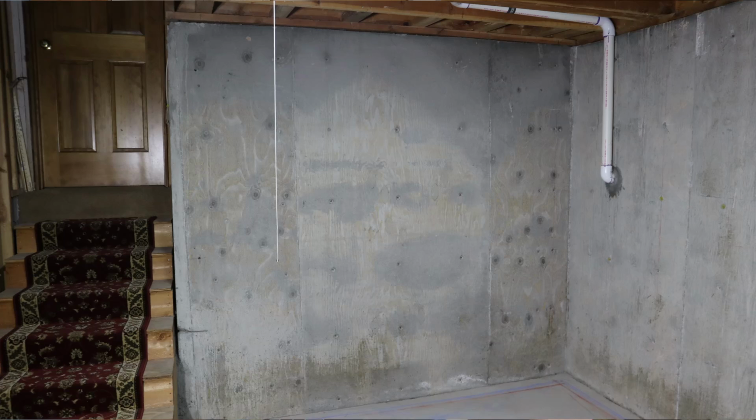And I discovered I had some issues. On the wall directly behind the camera, the center of the wall is bulged out enough that a 1/2 inch gap isn't adequate. And this wall is leaning in a little bit, and in some spots more than a 1/2 inch. So I'm going to have to step my wall out on both these walls more than I had anticipated. And the wall directly behind me is not only leaning in a twisty sort of way, but it's not square by a long shot.